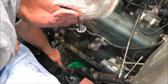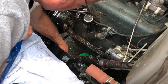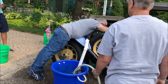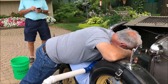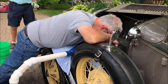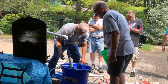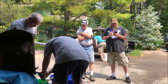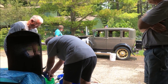Five, four, three, two, one — go! That last run was 23.3, so that's not bad. We know we didn't have a restriction coming out of the core, so it's probably pretty accurate. We found one more radiator to run. We got a good run on mine and we know how to do it now. You just have to have a better reservoir of water because you lose some the way we did it, but you catch it right out of the bottom of the radiator and you can get a good reading. We did it twice and were dead on. All the radiators we know of are flowing around 15 to 20.